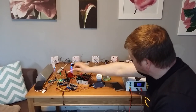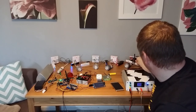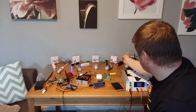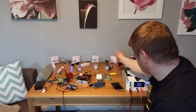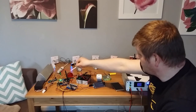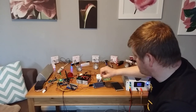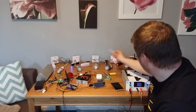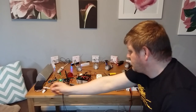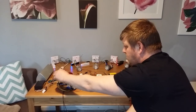So this one communicates wirelessly through NRF24L01 in each individual module. And each individual module has a unique address, so it recognizes which one is sending signals here, in order then to send via TX-RX to the display as well, and the display shows me what's happening with each individual module. The same also for the car radar, it communicates via software serial through the base.